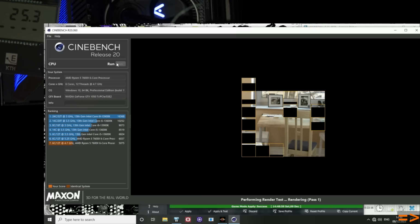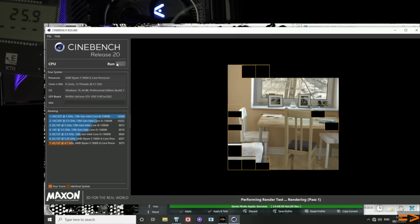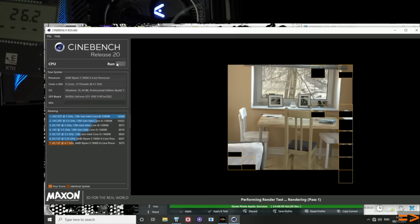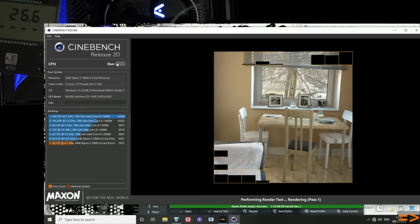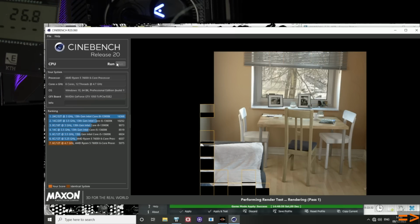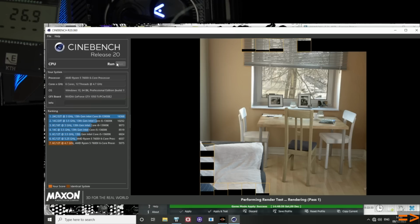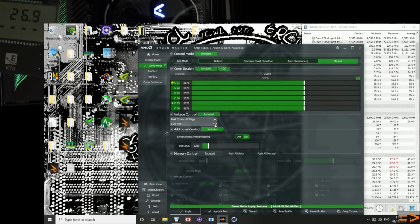Oh, very interesting. Yeah, so it was actually rolling over even at, like... That's crazy. It really hates voltage. It's still crashed, so yeah, I don't think... Well, I mean, we can keep lowering the voltage. Until it starts crashing earlier, we're seeing negative voltage scaling, basically.